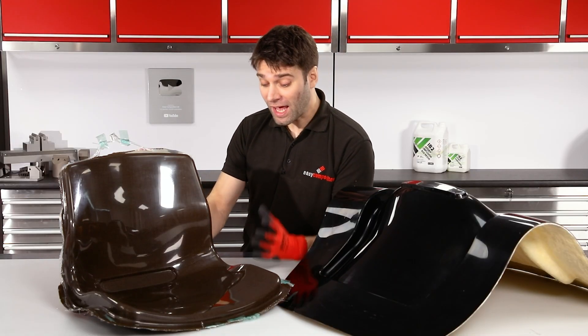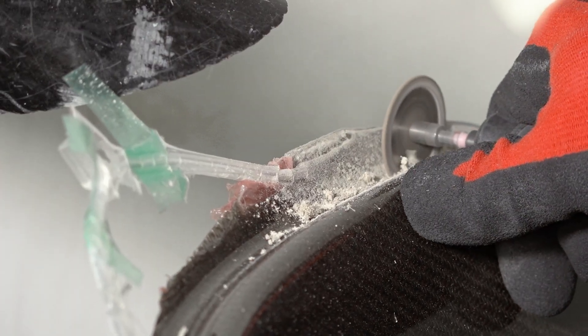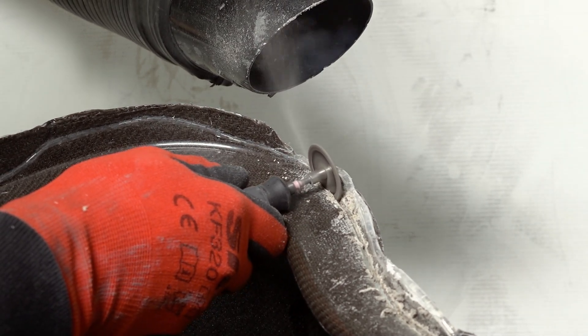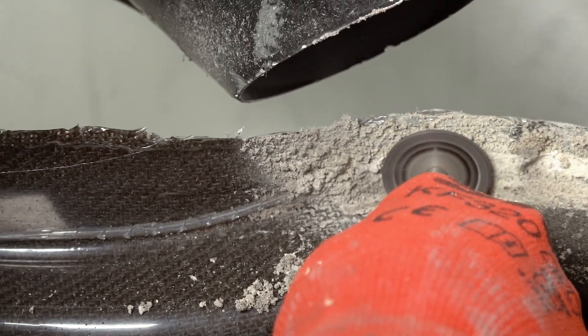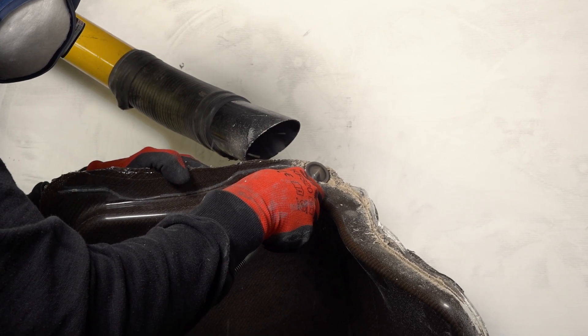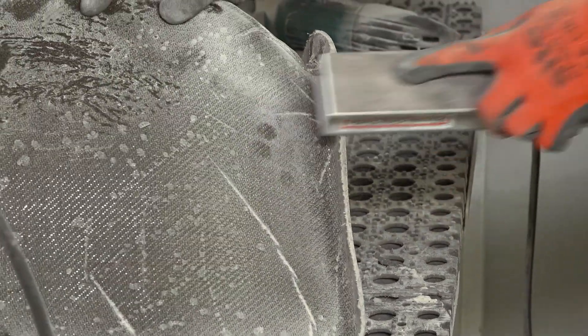Here we have the part straight from the mould — I'm really pleased with the finish. We have no air voids, no air entrapment, and I really like the warm appearance that flax fibre gives. For trimming I'm using a 32mm perma-grit wheel for the initial trim. Trimming flax is quite different to conventional composites: if you attempt to cut it with blunt tools or too fast a rate, the edges will burn up similarly to how plywood might. It feels a bit like a halfway between wood and fibreglass, so I suggest using coarser teeth or grits than you normally would. The trim line can then be trued up with a flap wheel, hit with a sanding block, and the edges softened down with wet and dry paper.